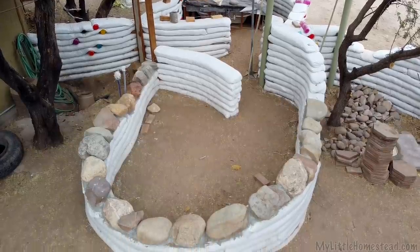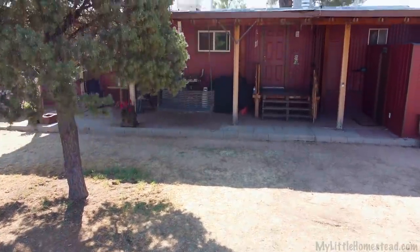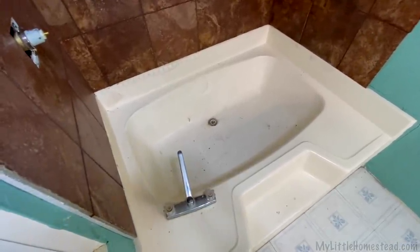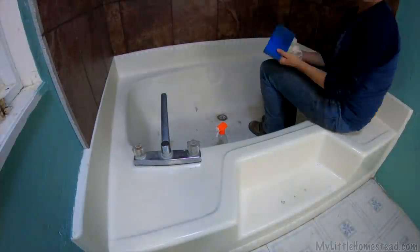This is the part that goes around the shower area. We're back on the bathroom this week and hopefully going to finish up the shower. The tub is old and used — it's got a lot of stains and it's kind of an off-white, and we want it to be white. We'll be cleaning the whole tub, patching any holes, sanding it down, cleaning it again, and then coating it in an epoxy we found. We'll see how it works.